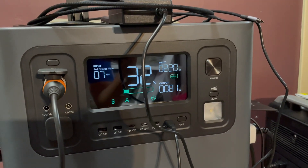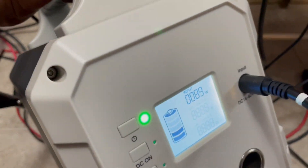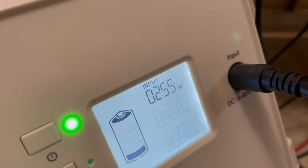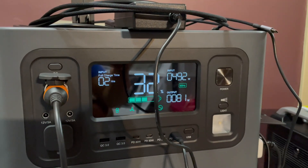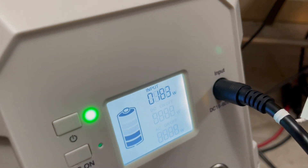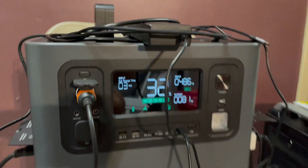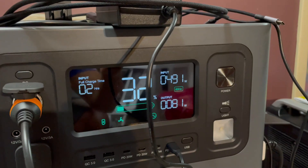Alright, we are turning up here on the 600-watt array. This one is a 290-watt panel, so let's get it plugged in and look at some numbers. About 248 — that's bananas. Yeah, this one got up to 500; I don't think I've ever seen this one that high. I'm glad I'm down here recording that. I'm about maxing out on this one. This one went up to two-something — all I really want to see is about 200 to 220 watts. Holy smokes, this is balling out of control. I think it's because the sun is hitting these panels after they cooled for a bit.